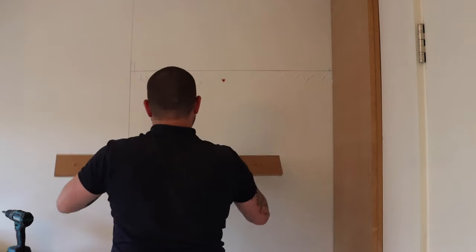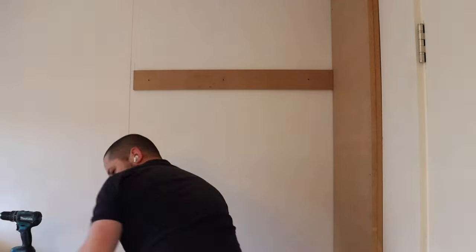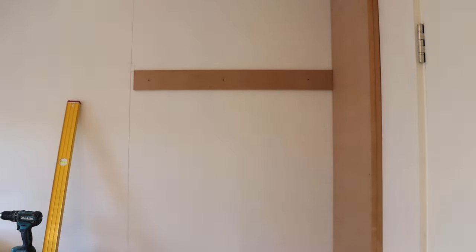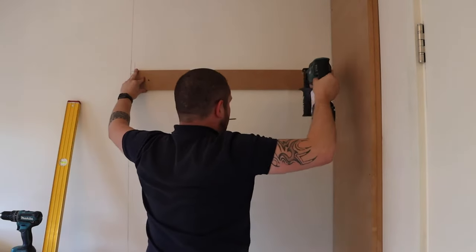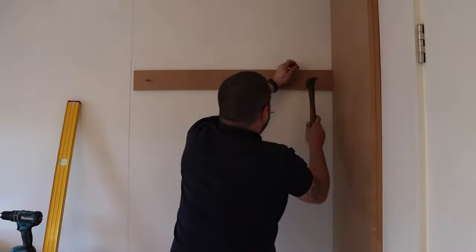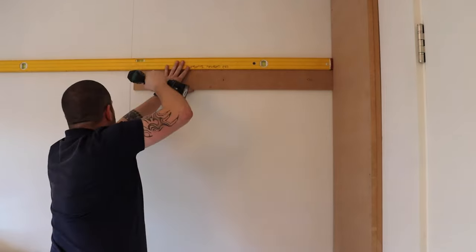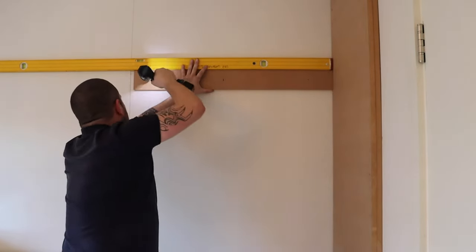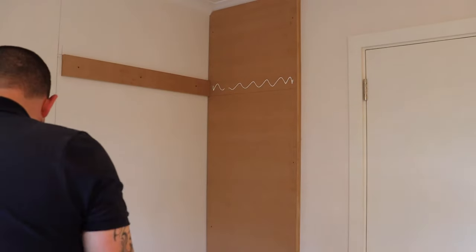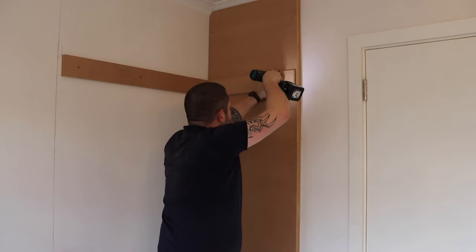This support here is essentially what's going to hold the top shelf on. The two bits you'll see me do later are what's going to hold the hanging rail in place. Like I said, this is a really easy way of building wardrobes — not the fanciest way in the world, but a really easy way of constructing them. By this point I'd gone and got myself another battery — it was actually more effort not to go and get it. This is that side brace I was talking about that's going to hold the hanging rail. I'll drill a hole in there later. Again, this is all just screwed and glued together.